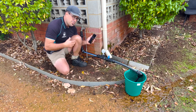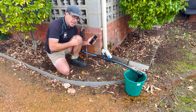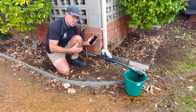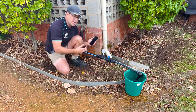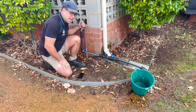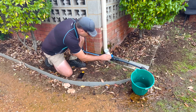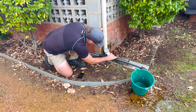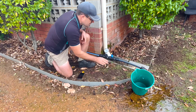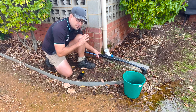We're now going to pressure test at 300 kPa. You will see that the same sprinkler will need a higher kPa or higher pressure to throw a longer distance — that's why we need to do this. We're now going to turn the tap on and restrict this to 300 kPa.